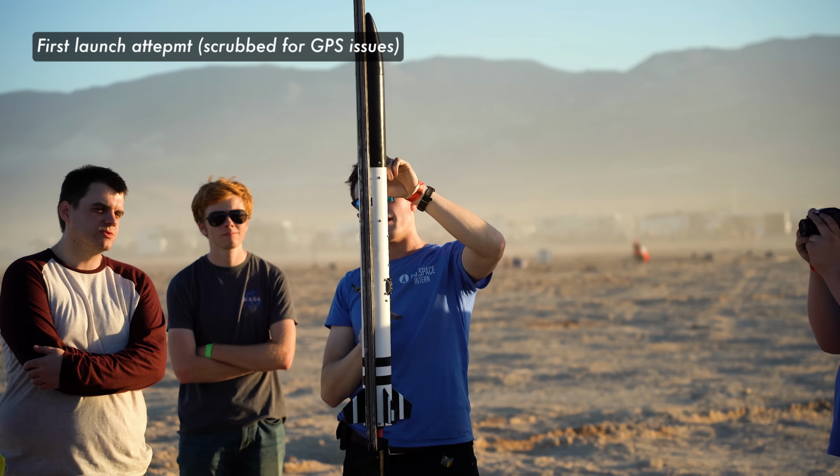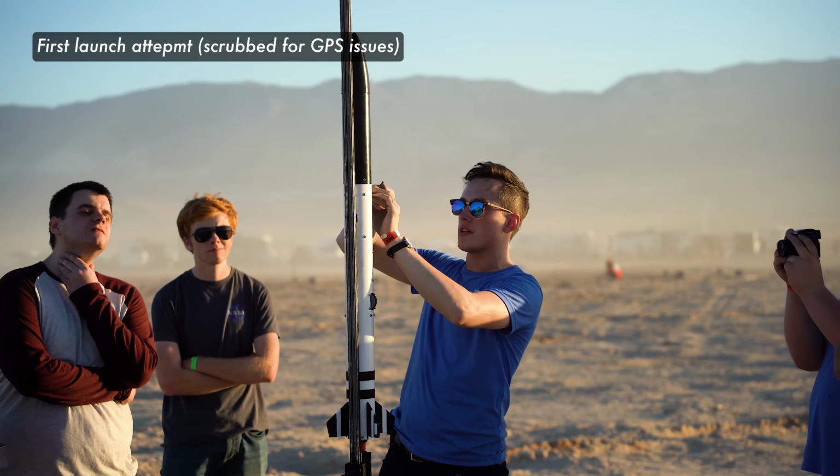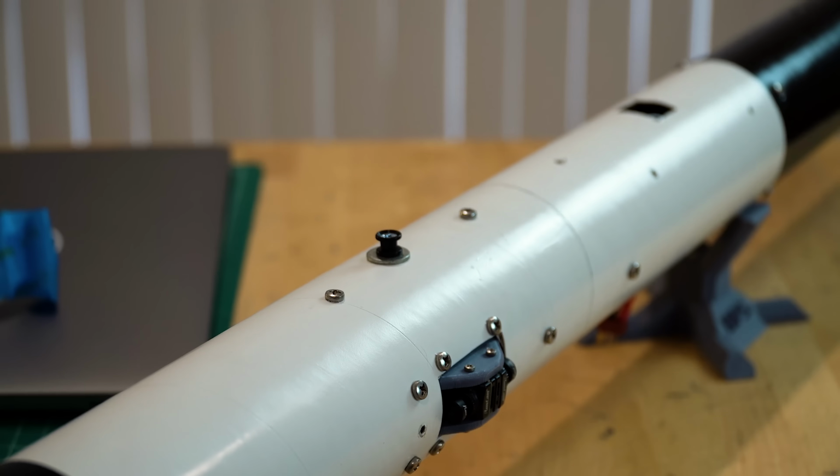The cool thing about this is that if I do it right, we can probably control the vehicle for a lot longer than we otherwise could. We don't need thrust to give ourselves control forces, we just need airspeed. Fineas gets launched from a rail with 10-10 or 1-inch rail buttons, which means that it should be able to fly at like most club launches.